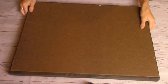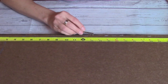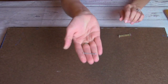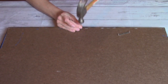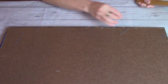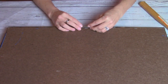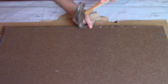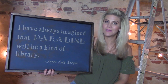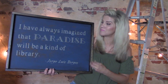I feel like this could have come out so much worse. Granted I envisioned a clean design, but this super vintage aged look is still pretty awesome — so go into your projects with a plan, but keep an open mind should things go awry. The final step is to attach a sawtooth hanger. Using my tape measure I'll find the center and flank it with the hanger, then apply some pressure to mark the spots where I need to hammer. I prep the holes with a nail first so I'm less likely to end up with a crooked hanger, hammer the nail at the two marked spots just far enough that the sawtooth can nearly stand on its own, then set the sawtooth back in and hammer it into place.